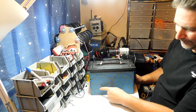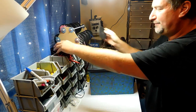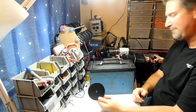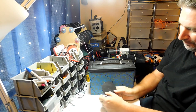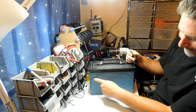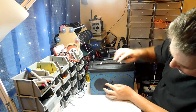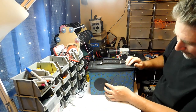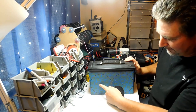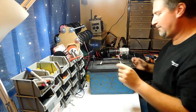The way I got the center position for my hole is: I took my hole saw and cut a piece out of plastic — you can use cardboard. I took my speaker grill and went ahead and outlined it. You set this on the box and try to get it as even as possible all the way around. Once you do that, go ahead and mark that spot right there and that's your center hole. Drill your pilot hole for your hole saw and it works out really perfect.